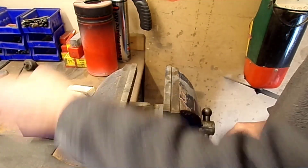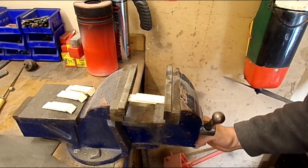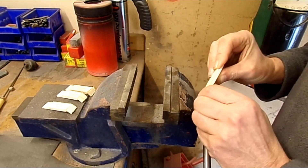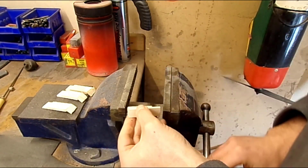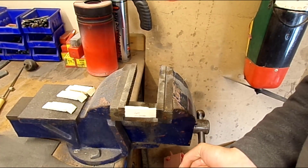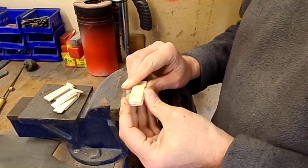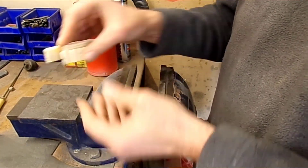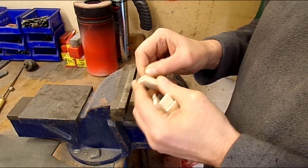And this is the one that was left unsanded. Quite unexpected as far as I'm concerned - I was expecting that one to possibly have split along the glue joint but it hasn't. So, quite a shock really. The T88 has managed to keep a really good joint going despite, in a way, poor preparation - unsanded. I've got to say, that surprised me quite a lot.